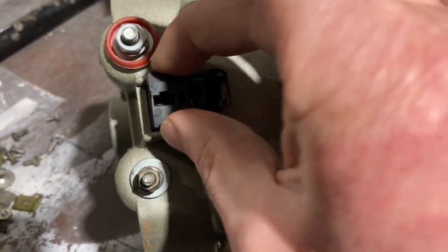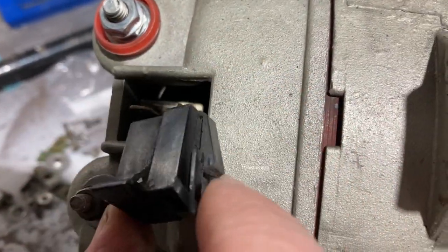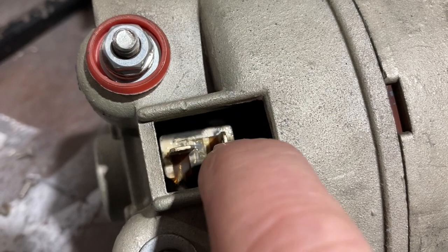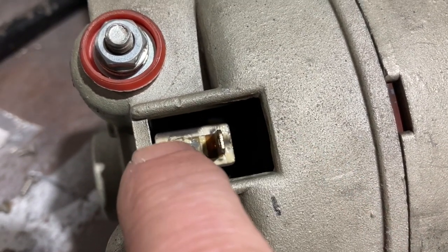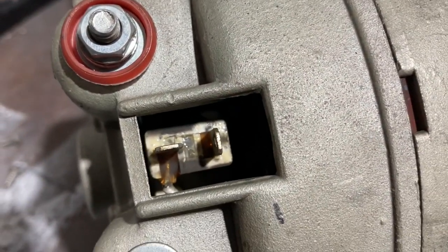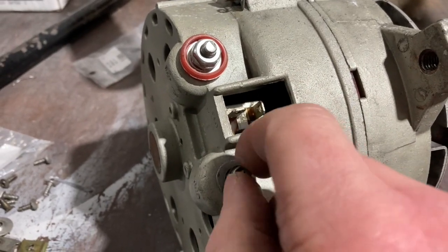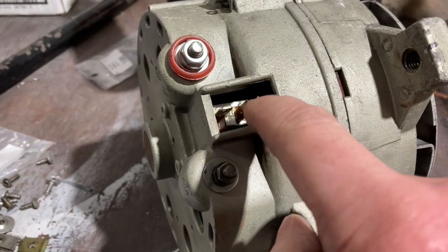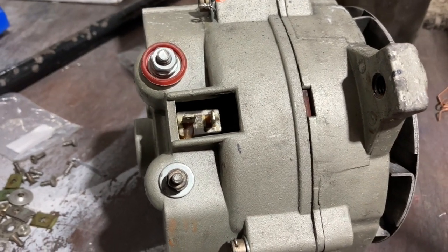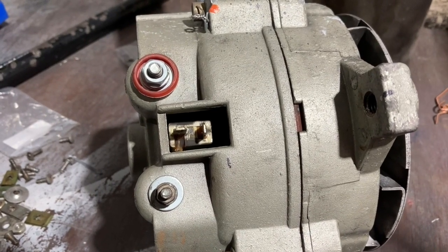There's a little plastic thing to help hold the spades onto the lugs, but it's just a bit of Mickey Mouse plastic. This is the STA and this is the field terminal — not used on a lot of these Cessna installations, but the field terminal is important. You need to clean that and do a general check of the crimped terminals. Most aircraft alternators have the field as a screwed lug as well, but on these ones it isn't, and they do give trouble occasionally — but that was not the case on this one, as we shall see later.